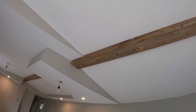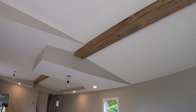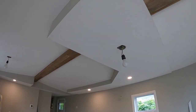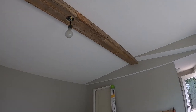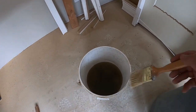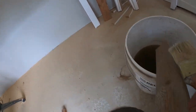Another thing you could do is put a bit of stain on to even it out, but it's pretty hard to beat 25 or 30 years of natural weathered finish. That old fence was in the back for about 20 to 25 years — it's got little wormholes, bug holes, places where it kind of rotted. The only thing I did after sanding was wash it — just a pail of water. Here you can see the dirty water. I just dipped my brush and went over it.